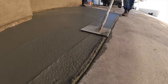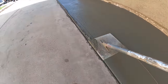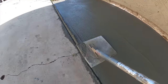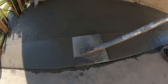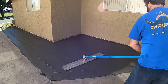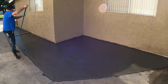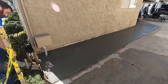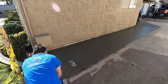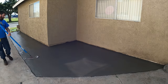That's a walking edger — 10-inch wide, half-inch radius. The reason I was going the other direction initially was just to get the concrete off the existing concrete, clean it up, and expose where I really need to run that edger, giving a nice clean surface that minimizes cleanup. When you run the edger backwards and scrape off the existing concrete, you don't want to throw that excess back into the new concrete and work it in, because a lot of times it has dirt attached to it. You just have to dispose of that excess.